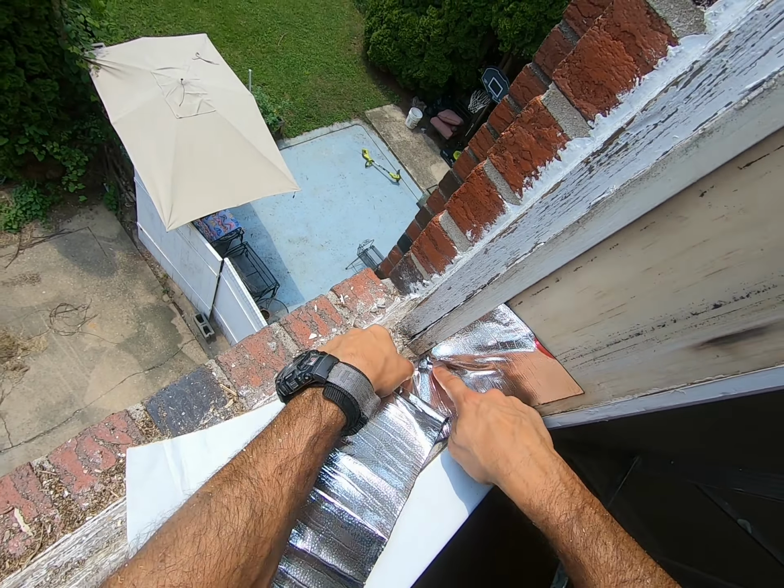They give you a top and a bottom in case you have gaps in the top and the bottom. I almost never, and you probably will almost never have a gap on the top, on the outside. It's usually the bottom because the windowsill is at an angle, okay? And this window is gonna sit right on top of it. So you'll see there is a gap of about half an inch or so. So this is perfect for that.